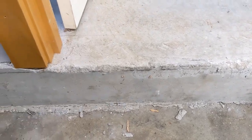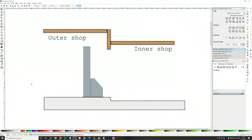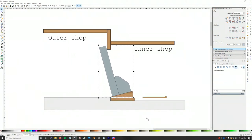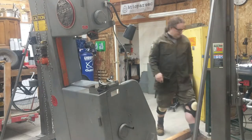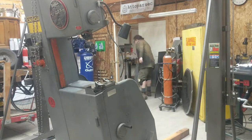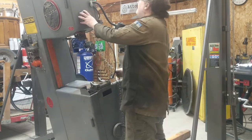So I took some measurements and thought about it. Laying it on its side wouldn't work — the whole thing is almost 700 kilograms. I could probably manage to lay it down safely in the outer shop using the gantry crane, but standing it back up again in the inner shop would be fraught, if not impossible. But I was feeling stubborn, so I did some advanced computer modeling, and I realized that the 6-inch step into the inner shop was a feature, not a bug. If I could tip the saw back by 15 degrees, it could be rolled through the doorway onto blocking, and then lowered to the ground. At that point it could be tipped fully vertical again, theoretically just barely clearing the door frame in the process. That was a big conditional, however. Could it rest stably at a 15-degree angle? It seemed possible. The CG should be low, since the motor and transmission are all on the base. But it was fundamentally an empirical question, and there is only one way to resolve those.